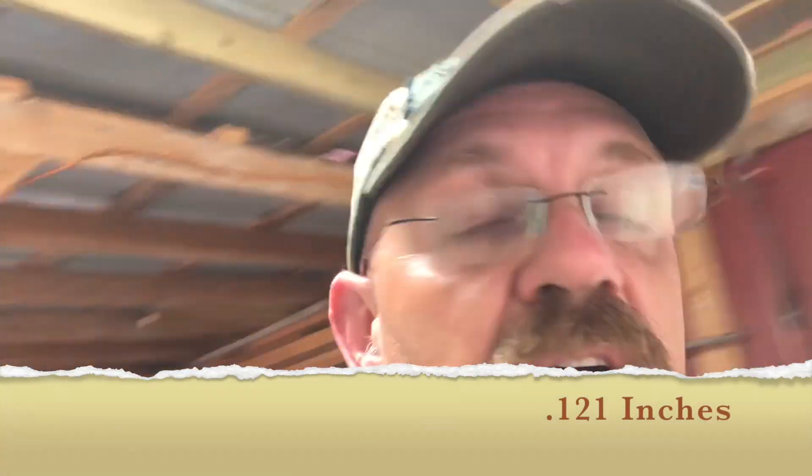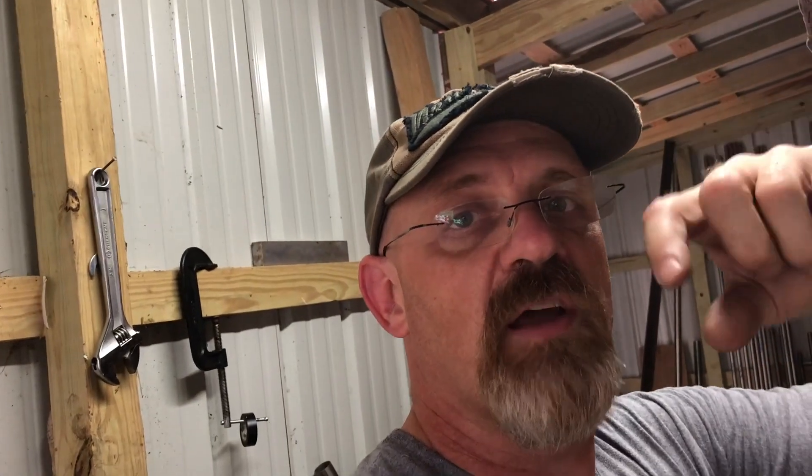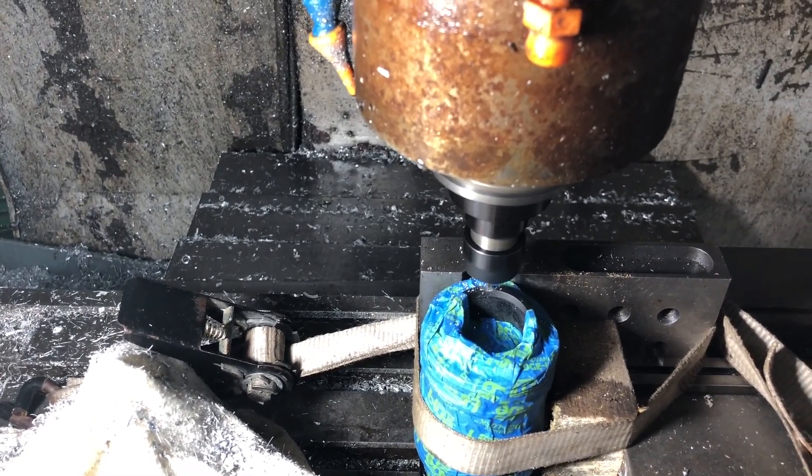What I've done so far is I have measured the height of the shelf. This older lens is 142 thousandths. The little mount is 121, and I looked on my 85 mil and the chip is even with the flange. So I'm going to cut mine to 135 — that'll put me about five or six thou above that steel flange, which will prevent me from potentially damaging the mounting flange of the lens. I'm just cutting away this aluminum wall to make room for the chip, and I'll do that over and over until I've cut the whole shelf away.